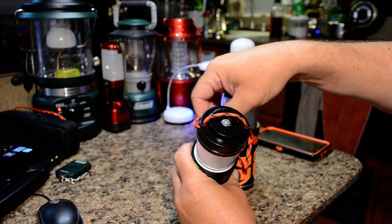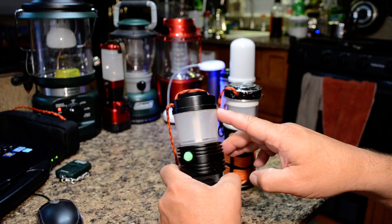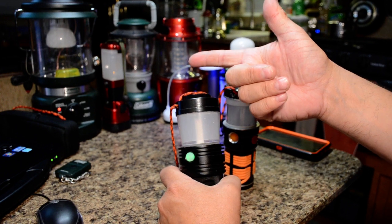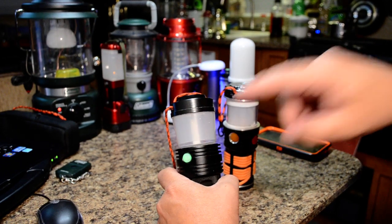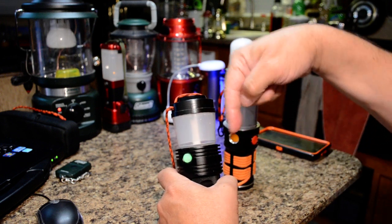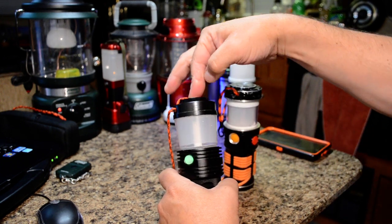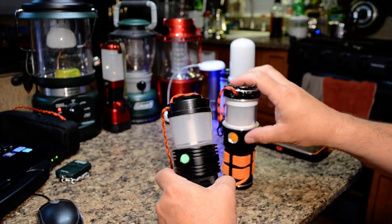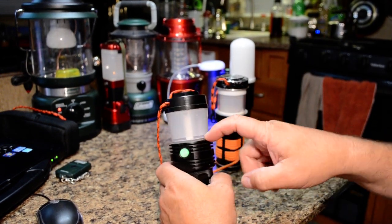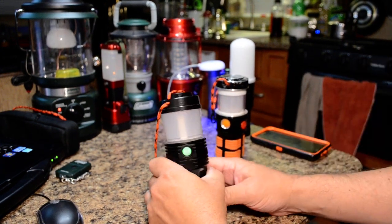There's also an O-ring underneath the head of the bolt, so when the bolt is tightened down it seals right there. The top of the globe has an O-ring fitting into a groove inside the top cap, and the base has a recessed area with an O-ring, so when all this is tightened together the O-rings are compressed between the globe, the top, and the bolt. This entire top section is now watertight and rain resistant. Having the globe as one piece makes it much easier to seal with O-rings.